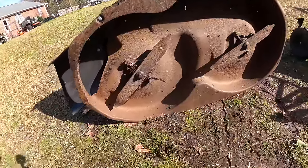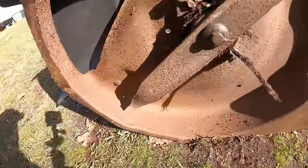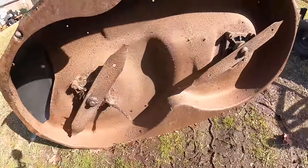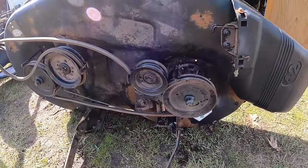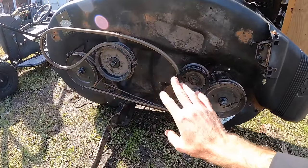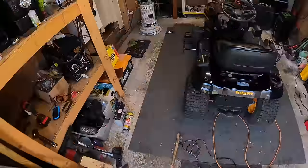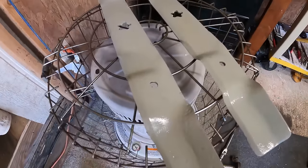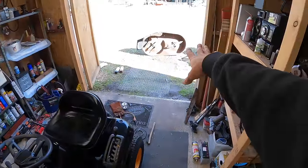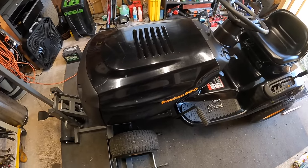We got the mowing deck off. There's stuff caught in the spindle and there's not much left of the blades — one is actually rolled over with a hook on it, and the other side is about the same. On the top side everything looks good. I've started scuffing down the paint — no cracks or holes, just a little surface rust. I've got some metal primer and we're going to do satin black on this mowing deck. I had another rotted-out mowing deck with good blades, so I've balanced and sharpened those and threw a coat of rust preventative on them.